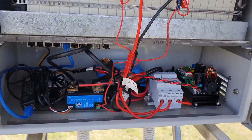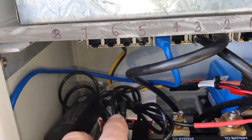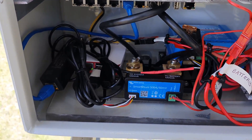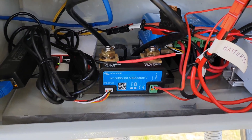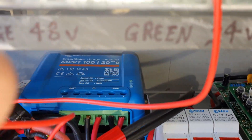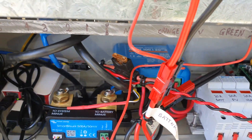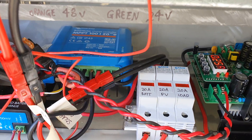You'll see a little Raspberry Pi just there — it's a Raspberry Pi 2 — and what that does is it has some Victron software in it for monitoring. I've got a Victron smart shunt that actually plugs into the Raspberry Pi, and you'll also see a Victron smart MPPT controller running all the gear, which also runs the VE.Direct port back into the Raspberry Pi.